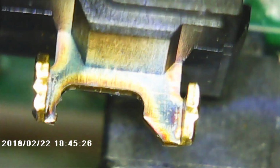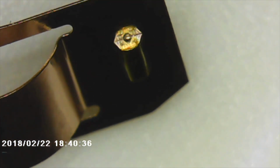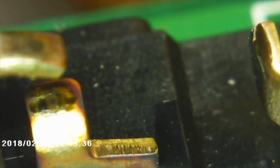But the construction, the alloy, and the treatment of the permanent contacts on the base were all absolutely identical, but the tolerance and the quality of the actual contact rivet seemed to be slightly higher with the 10 million cycle, so maybe that's the only difference that they do. And I imagine for like the 20 million to 50 million, they improve that rivet even more, and they probably give you different materials for the spring clicker plate. But the tension and the shape of the plates themselves was identical. Visually, the metals were identical, and they were the exact same thickness at 0.6 millimeters.